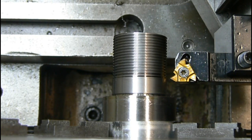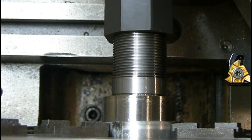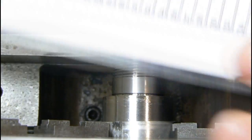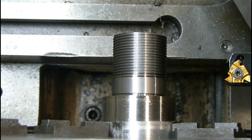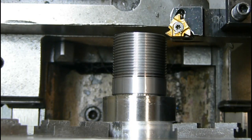Check the receiver by hand and get a better fit. Nice and smooth. All right, it just wants to start and I've got 35 thousandths on the compound. For 18 threads per inch, it says I need to go in advanced compound at 41.7. But I don't go in all the way like that. I'm going to go in a couple thousandths at a time. Test it again. I just don't know the tolerances on the receivers, so I just don't go in full bore. This pass will take off 2 thousandths on the compound.